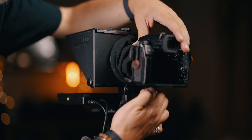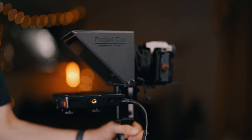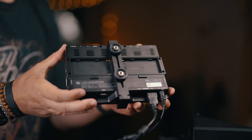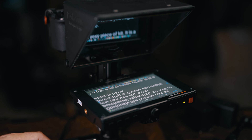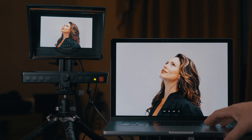You can change the back sled to attach a proper camera to it. The next step up in the modular build for this prompter — the whole back changes to accommodate a camera with a lens. This back cover contains a cloth hood that can be tightened around the lens. It can still be mounted horizontally or vertically as standard. The top option, and my favorite, is this new 16 by 9, 1800 nits ultra-bright high quality monitor. This is a specialist monitor designed for teleprompters — it simply reverses the display so it looks correct in the mirror. You connect your computer to it via HDMI cable and run the Telescroll software from the computer.